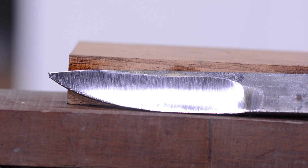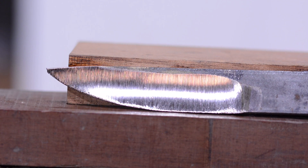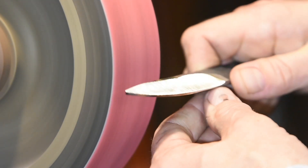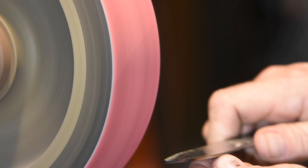When it comes to hollow grinds, basically there's just one standard hollow grind. The advantage of the hollow grind, first from a manufacturing standpoint, is that you can do them on big wheels. In the early days of the cutlery industry, great big rotary wheels were used rather than belt grinders. Back in the 19th century they didn't have belt grinders, so rotary wheels were a natural way of manufacturing knives using that hollow grind. It sped up the process over the methods that would have been used for flat grinding at the time.